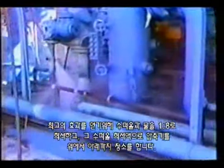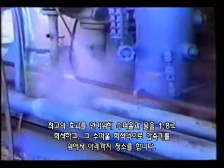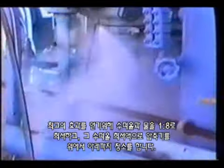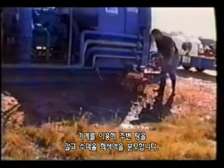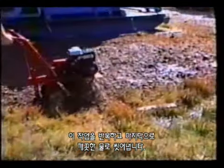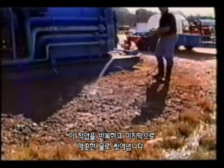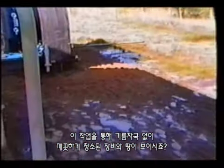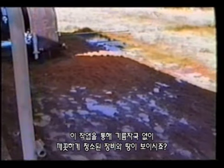To achieve maximum efficiency of the cleanup, a mixture of one part Superall to eight parts water is used to wash the compressors from top to bottom. The surrounding surface area was tilled and sprayed with Superall and water. Tilling was repeated with a final freshwater rinse. Note the results of this procedure leaves the equipment and soil clean and without a hydrocarbon sheen.